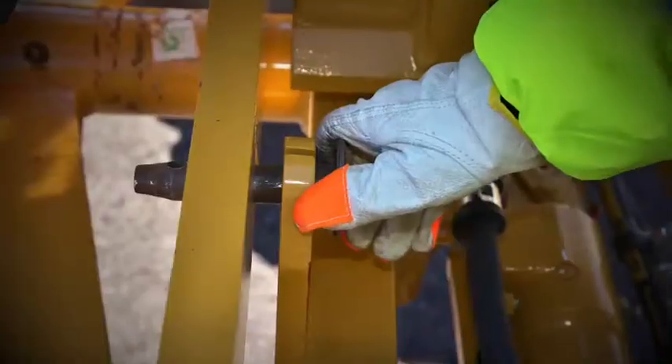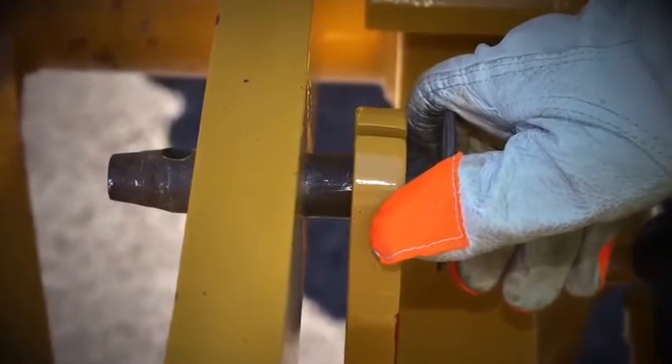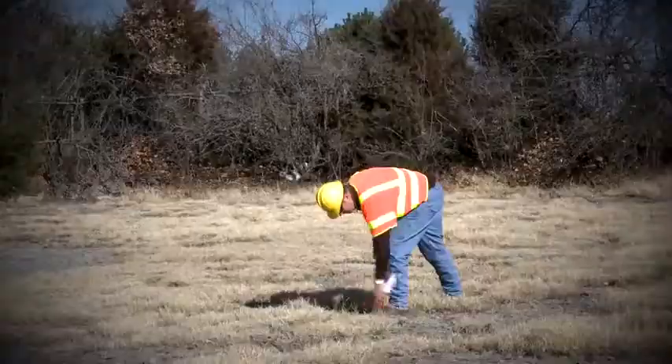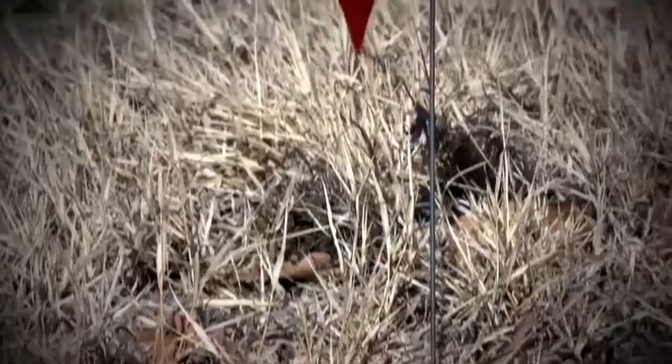These will hold the front and rear frame rigid and hold the front wheels in their upright position. Lastly, and before any grading is performed, be sure the utility services in the area have been notified and that the job site is marked for possible underground lines or structures. This is extremely important. Grading through a gas or electrical pipeline could be fatal.